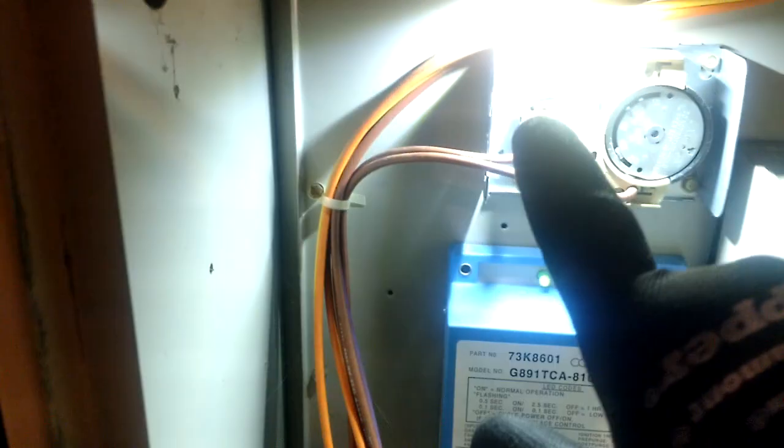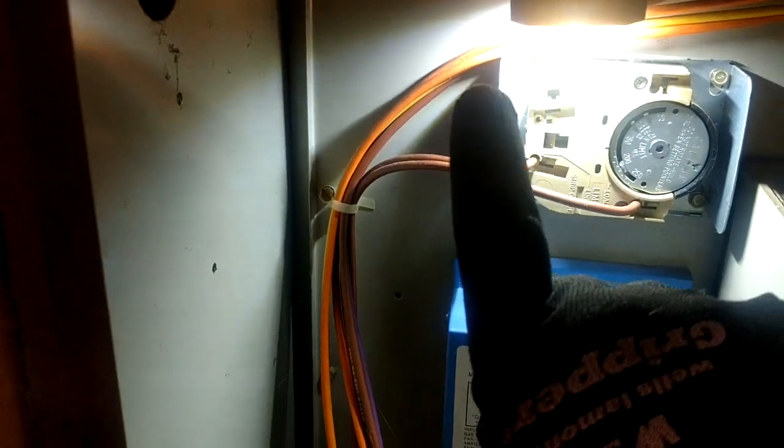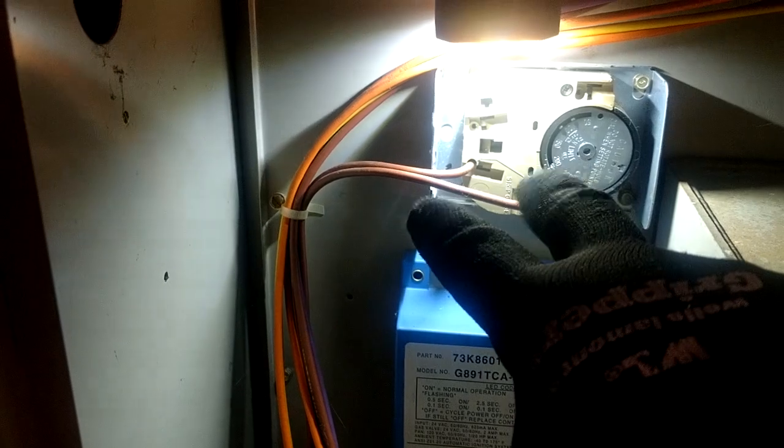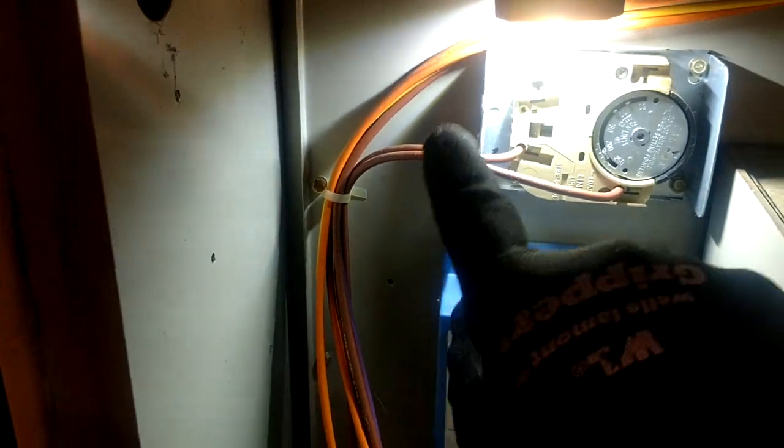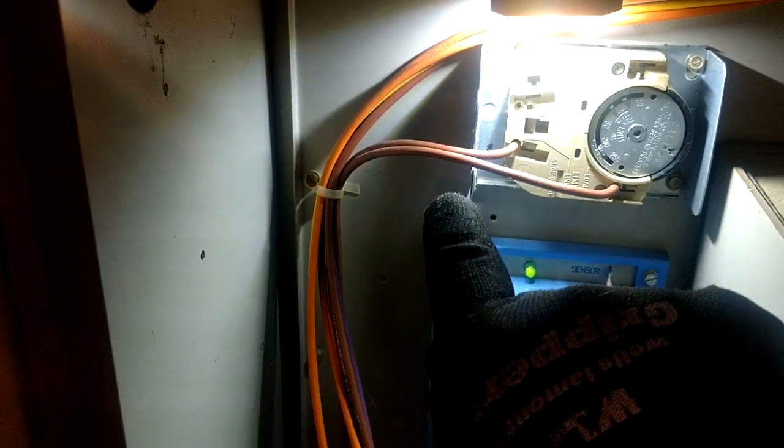The purpose of that is it is telling the furnace that the flames lit all the way across — they didn't stop in the middle somewhere with gas spraying over the last two burners. It's telling that furnace there is a flame in front of me; I'm in a flame right now.